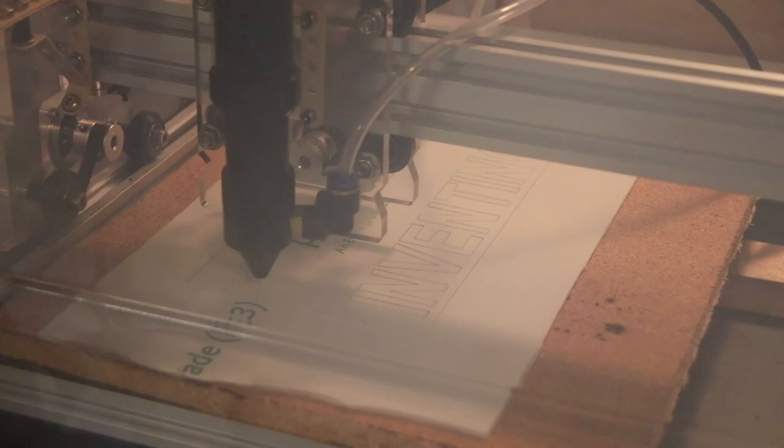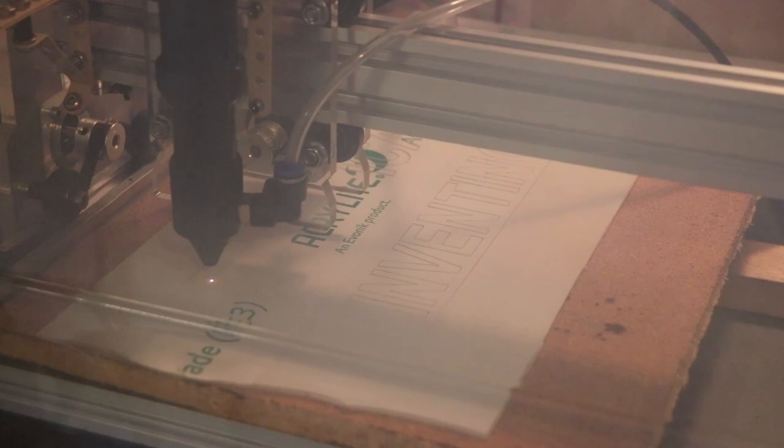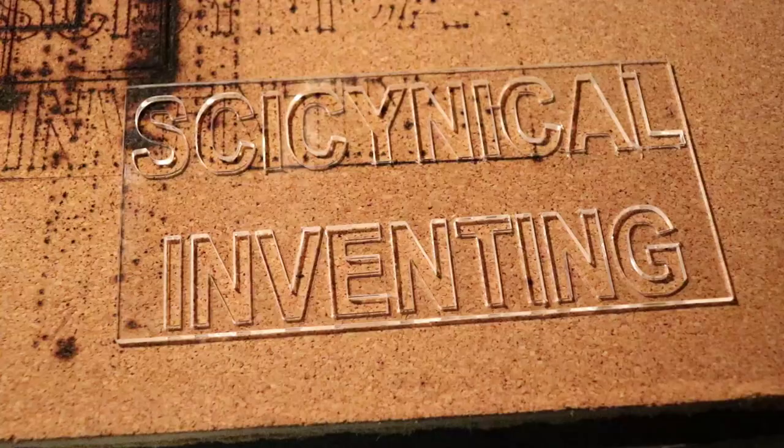There was one more thing I was very curious about, and that was if my laser could easily cut plexiglass. And I was absolutely thrilled to see it working and cutting this 3 millimeter thick plexiglass in one pass at about 20 milliamps. This opens a lot of possibilities with my laser cutter, and I'm really excited to be able to use it